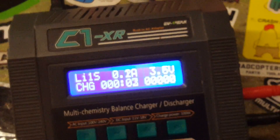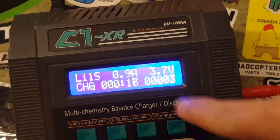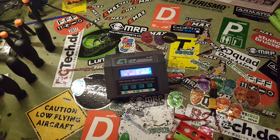When charging is done, wait about 1 day and see if it's still at 4.2 volts. If it is, then discharge it. When it's done discharging, you can see the capacity that has been discharged in the corner of the charger display — that tells you what capacity the battery still has. For example, if you had a 2,600mAh cell and still have around 2,200mAh left, that's really good. But if you have 1,000mAh or less, I recommend you don't use them — the capacity is too low to justify the weight, so just recycle those.